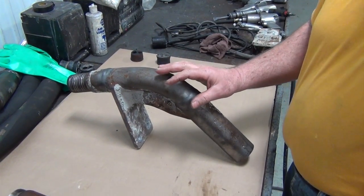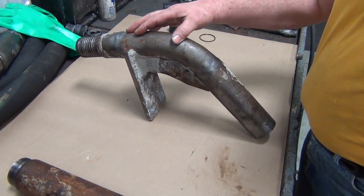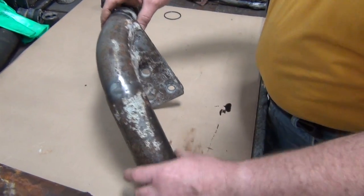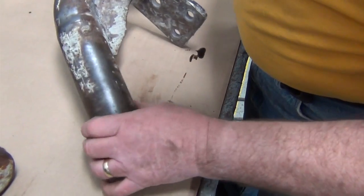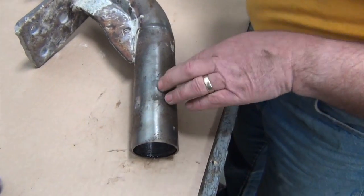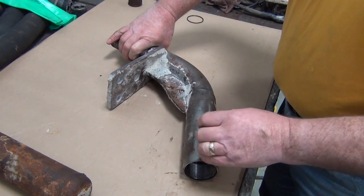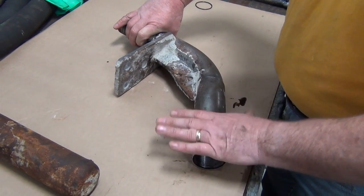This time we'll inspect our parts that we've disassembled from the vibrator. We'll start with the vibrator motor housing. We've cleaned the welds as you've seen prior to around here and our weld points, and also here on the sides where the balls are located. That was kind of tough to see. There's two more that are a little easier to see. As long as those are nice and flush and aren't showing any kind of holes or anything like that in there, then those are fine.